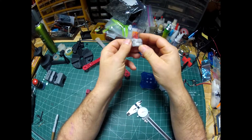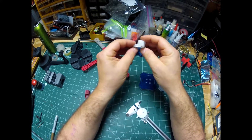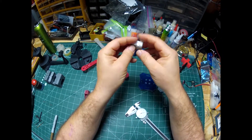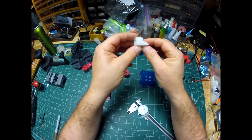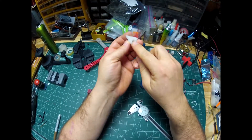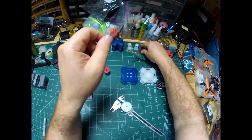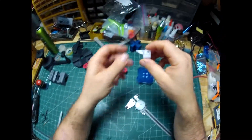We're not going to be using one of those center sections today. This here was an experiment printing in polycarbonate - super strong. You just put this in a vise and it does not break. But it's very tough to do without warping. I also tried nylon - also super strong, pretty much got that method down, but nylon is very slippery and very hard to clamp to carbon. So for now we're just using the PET plastic.